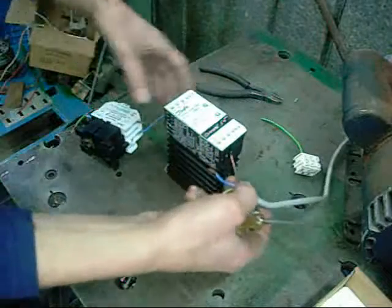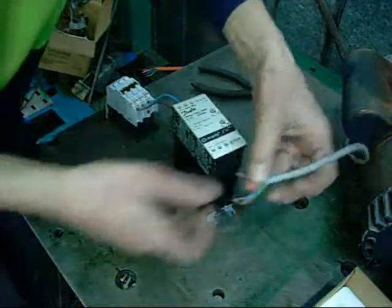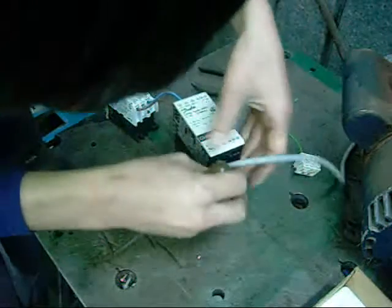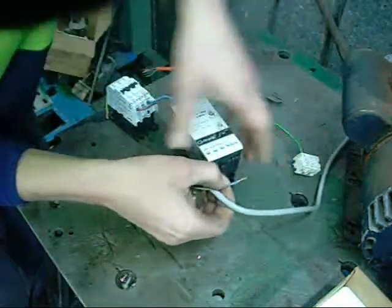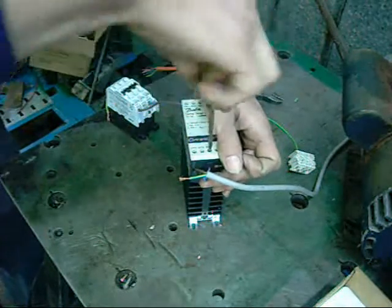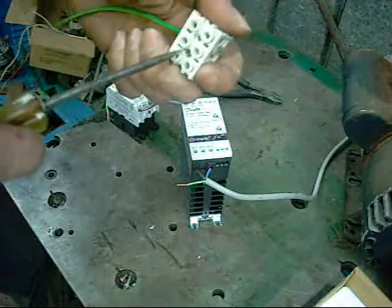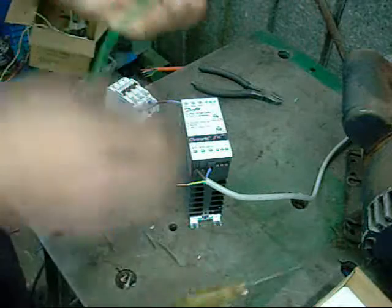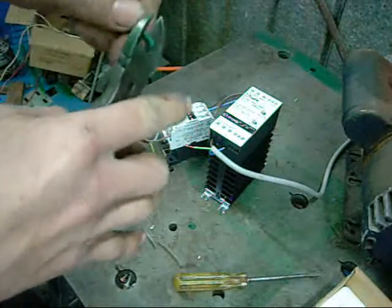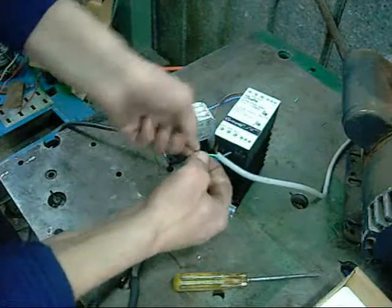Next step is the motor. T1 is your live motor connection. Make sure all your connections are good and tight and that you've got fresh copper conductors. Don't use aluminum core wire — I think it's illegal in most parts of the world, and for good reason. Aluminum wire joints had a habit of getting oxide buildup on them, and the subsequent heat caused them to come loose and start fires. Aluminum core cabling was used in the US for quite a while but is understandably illegal now. I've seen it appear a couple of times in Australia, but it's usually illegal or illegally installed.